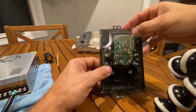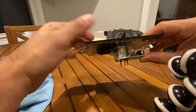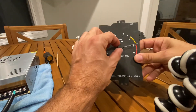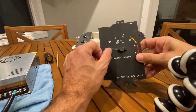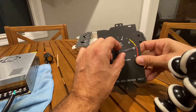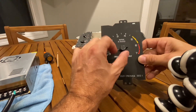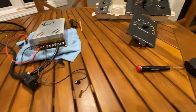Once you have your tach in hand, you've got your three wires — 12 volts, ground, signal — and your tuning pot, and that's how you set it up. You're never going to get it perfect, but you can work the range to be where you need it. One of my tachs motivated me to figure this out because I'd be shifting at what I thought was 5,500 RPM and it was really at 7,000. I adjusted it and it's much better now. I'll post links in the description. Hope this video helps — thank you.